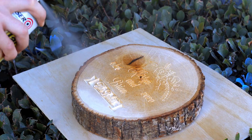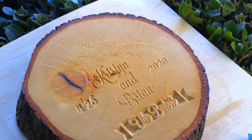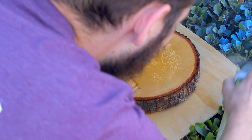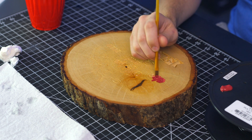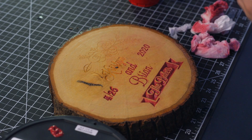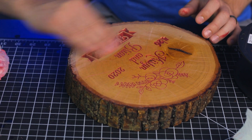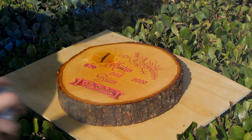This shellac is super easy to work with — just give it a light mist, wait till it's tacky, then spray on the second coat. Once I gave it a couple coats of shellac, I wanted to sand it since shellac raises the grain. Sanding removes those little bits and gives a much smoother surface before going back with more shellac. The shellac also helps seal the wood so I can use paint in the grooves of the carving without it staying in the wood grain — I can just use a wet paper towel to rub off all the paint. It's important to do this in stages so the paint doesn't dry on top of the wood. I gave it one final pass of sandpaper to remove any bits of paint that seeped over the edge of the lettering, then sprayed the whole thing again for a smooth finish.